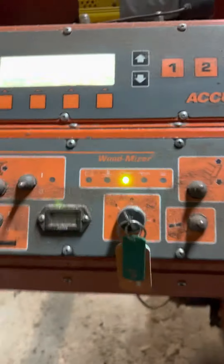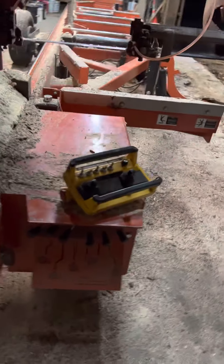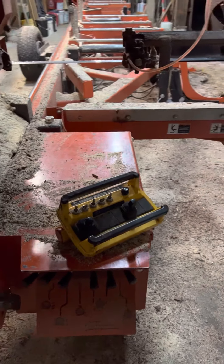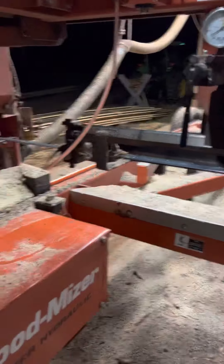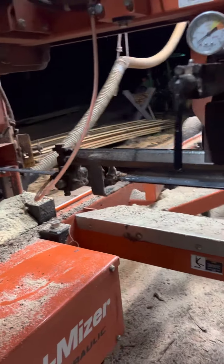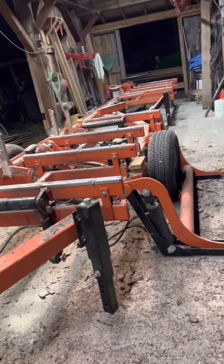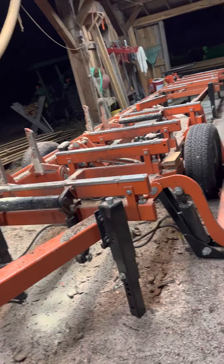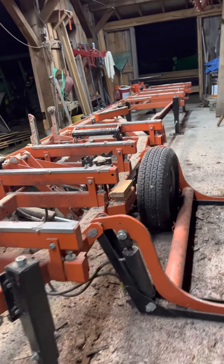You've got your controls here if you want to walk behind it, but for me I'm all about the wireless controller. So that's a little bit of the sawmill — LT40 Wood-Mizer, standard head, inch and a half blades, seven degree pitch. Primarily we're cutting pine, hemlock, and we do cut a bunch of oak. I use four degree blades for oak. But this is our sawmill setup.